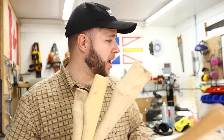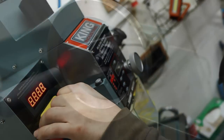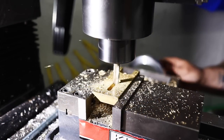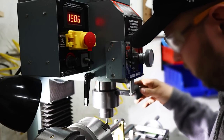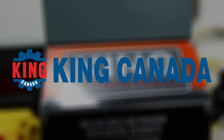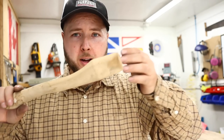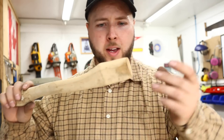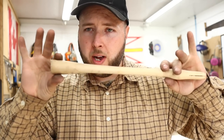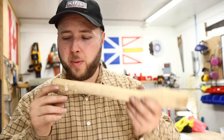There are a lot of things to touch on when selecting the proper handle. Handles alone have a whole set of different terms and nomenclature — when it comes to your saw cut, your kerf, the shoulder of the axe, what some people call the fawn's foot at the bottom, the swell, does it taper in one dimension or two? Axe guys really get hung up in a lot of these details about what makes the perfect axe.